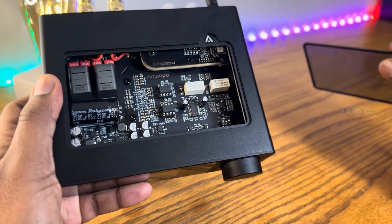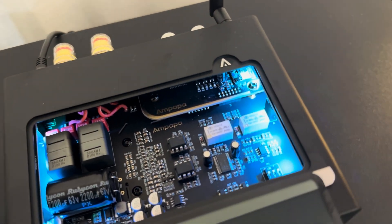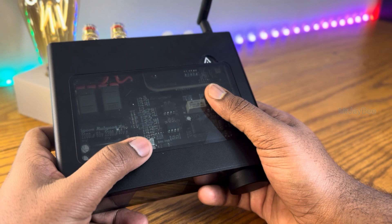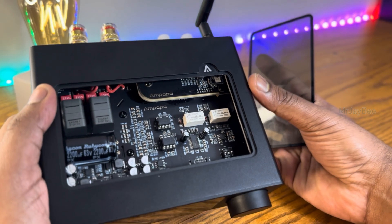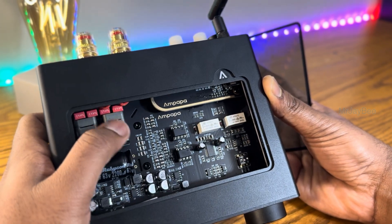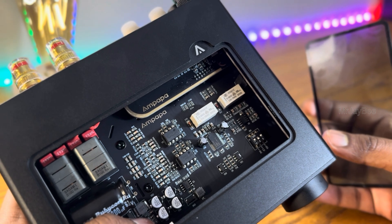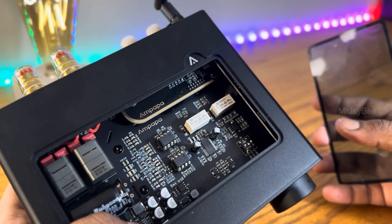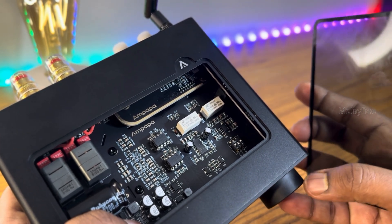Other technical highlights include Bluetooth 5.2 with a Qualcomm QCC3040 chipset supporting SBC, AAC, aptX, and even aptX HD. It also has PFFB — post filter feedback technology — that enhances clarity, lowers distortion, and stabilizes response across different speakers. It features NJM5532 op-amps which are easily replaceable via the top window and can be upgraded to OPA2604, OPA2134, or even MUSES02. The NJW1194 chipset acts as a pre-amplifier controller managing volume, tone, and input switching with precision and low noise. It also uses a two-ounce copper PCB for better current handling and lower resistance, along with premium components including gold-plated speaker terminals, Wima capacitors, Japanese Sagami inductors, and Rubycon capacitors.